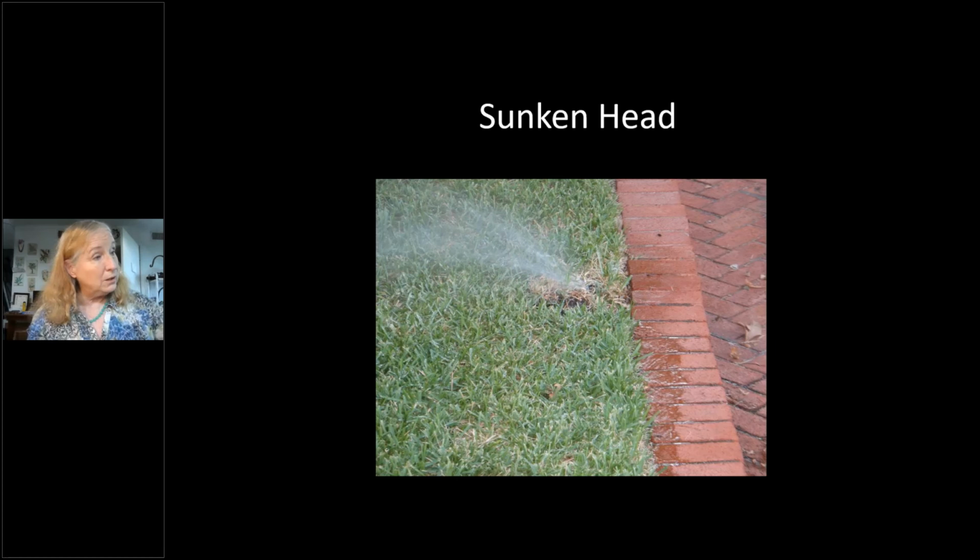Or the soil has built up. This needs that little tool that I demonstrated to you earlier, to bring that up to the right level. And so this tool, like I said, is sold in any Lowe's and Home Depot. You're going to have to look for it, but you can put your sprinkler head here, and this goes on the riser, and then you can cut this the length that it needs to be to get that up out and distribute the water properly.